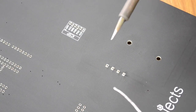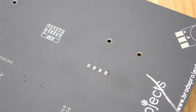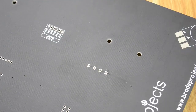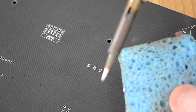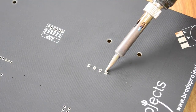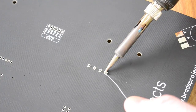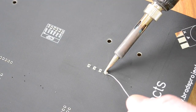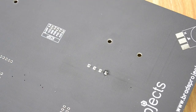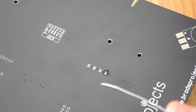A lot of people when they solder keep moving the soldering iron around when trying to solder in different places — don't do that. First, make sure the soldering iron is clean: wipe it on the sponge so it's nice and shiny and silvery. Then put the soldering iron so it touches both the circuit board pad and the leg of the component. Let it heat up for a couple of seconds, then get the solder so it touches all three at once: the circuit board pad, the soldering iron, and the leg. The solder will start to melt — don't move the soldering iron, just move the solder around. If you take the soldering iron away it will cool down and the solder will no longer melt.